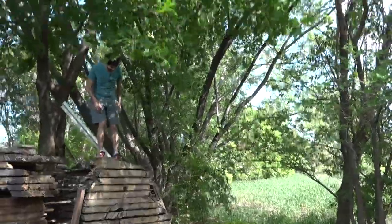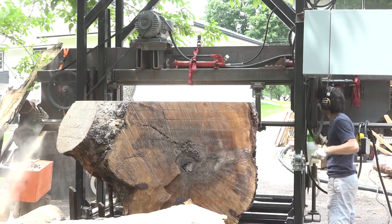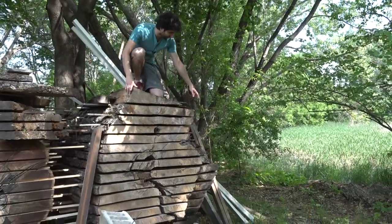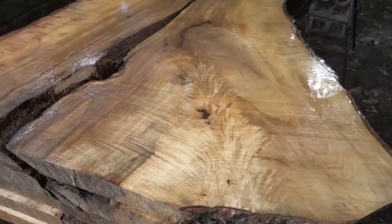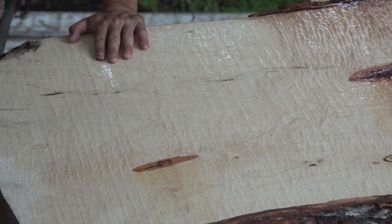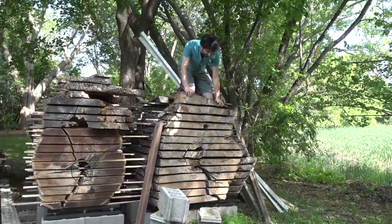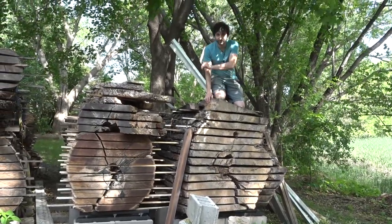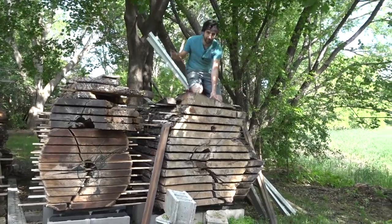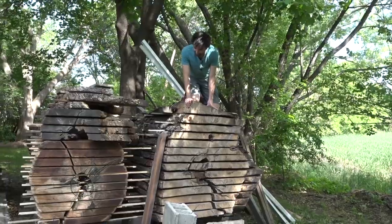I'm not as young as I used to be. This silver maple crotch I picked up in an alley in Robbinsdale, Minnesota — I have a video called Urban Logging Strategies where I went and picked this up, about two years ago. It has a ton of figure, five feet at the crotch and about four feet at the other end. At about 10-quarter thickness, this took about 18 months to reach outdoor equilibrium — versus the spalted stuff we looked at earlier, which dries much faster. Spalted wood has lower density because it was partially rotting, so it dries faster than this healthy, denser silver maple, though silver maple still isn't super dense and dries relatively quickly.